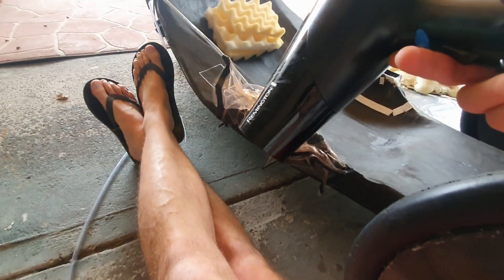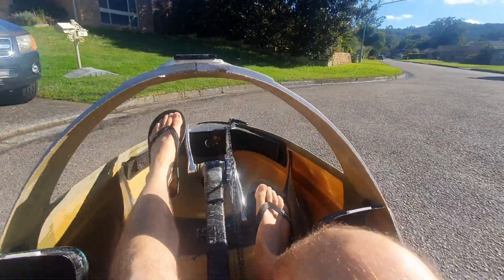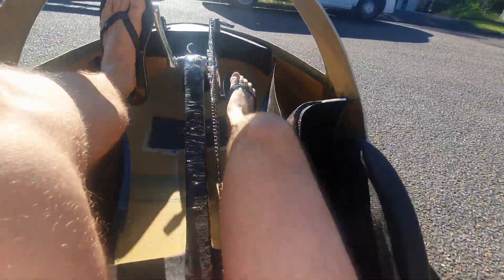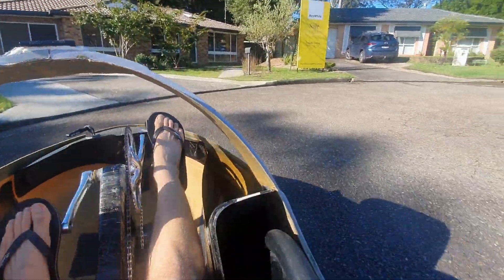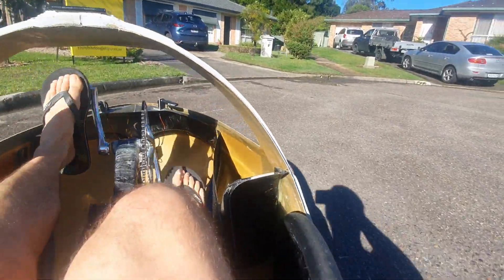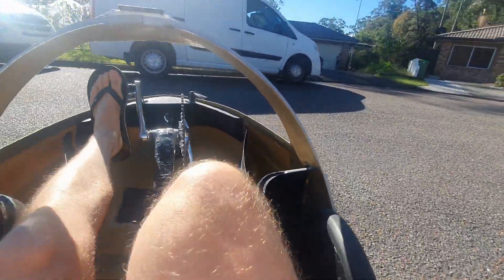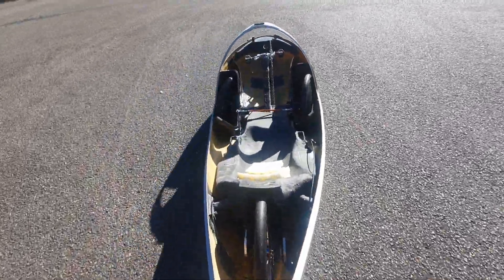Just testing out the steering angle of the bike out in the cul-de-sac. Full lock with the wheel scrubbing is just good enough. I might have to get the smaller wheels — these are 1.5 inch and you can get a 1.35 — so I've got a little bit more clearance and can get the angle a bit better. This is pretty good, quite happy with it.